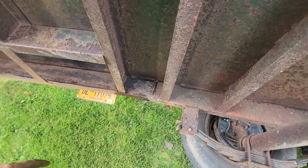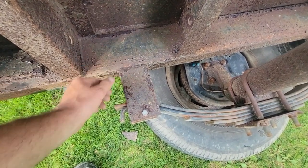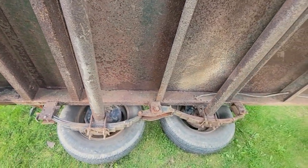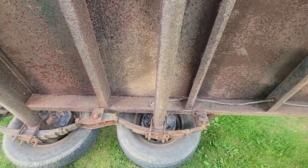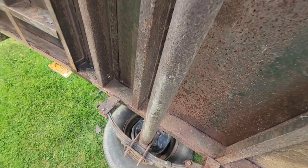And when you look at your springs and you see where it attaches, this is where you got to be concerned if there's any rust jacking, anything going on to where, you know, it's weak. And these look pretty good. There is a greasable fitting in there. I'm going to work on that probably at the end because I can get it from the outside.